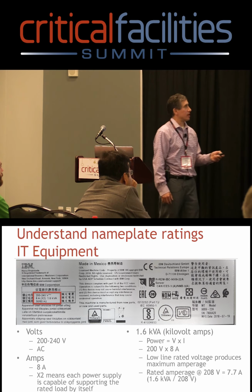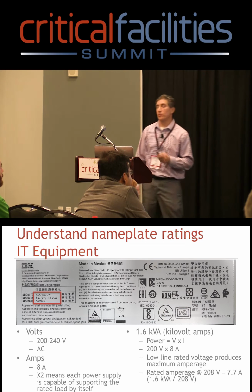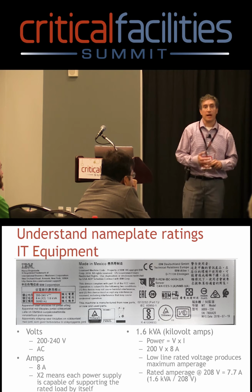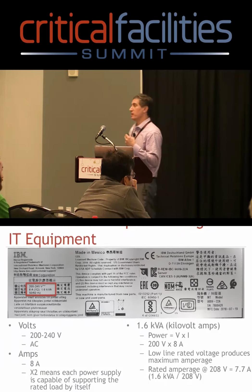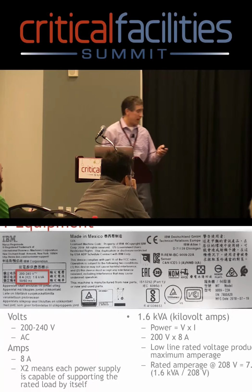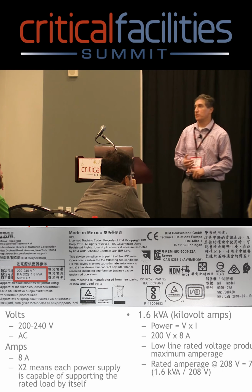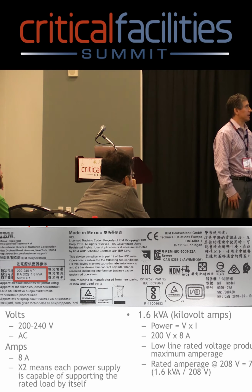What I'm really going to focus on is some of the ratings. Now I'm going to show you a few different ones, but we'll start with this one. So this one is 200 to 240. Now that's the rating. Can it operate wider than that? The answer is yes. And I didn't put it on here, but we'll test a product to -10, +6%. So it'll be -10 off of the 200, so that's 180, plus 6 off of the 240, which comes out to 254.4, I think. If someone wants to check the math, you can.